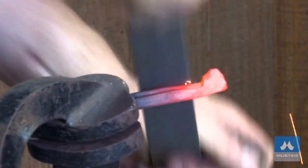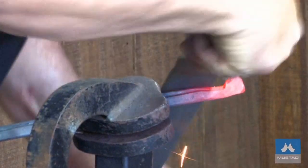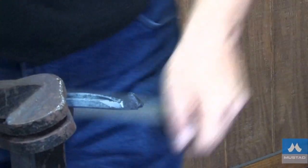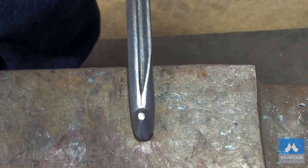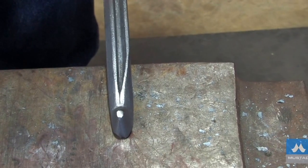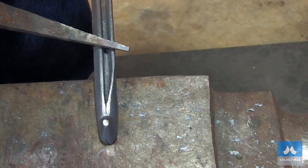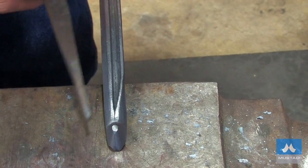The first thing I do is try to create the lines that are in the picture where the concave runs to the center. Where the concave has been squashed, I take the rasp and create new lines — the back like a heel. I'm trying to sculpt this into something that looks like it's growing out of the shoe. A lot of the shoes are going to look the same, so it's the quality of the heels that will really make the difference when it comes to judging. We've got our wedge finished and rasped up. The concave runs all the way along and then starts to come to center. We've got a nice finished area in front of the wedge — concave inner edge, safing on the outside edge. The wedge itself leans slightly to the inside — it's a really safe wedge. What we're looking for are the features that are in the picture of the Calgary program.